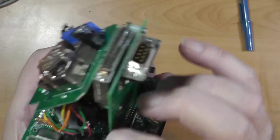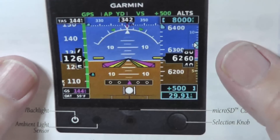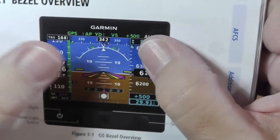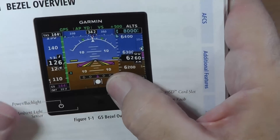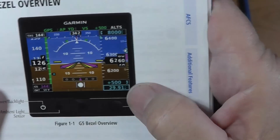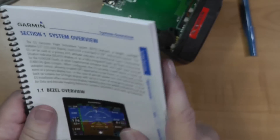The new G5 is about a third as big as this — much smaller, yet it has a full screen on the front. It uses a computer-style screen to provide the information. Here's what it looks like on the G5: it gives you the artificial horizon with the blue and the brown, plus speed, altitude, track, the slip ball, pitch attitude, and true ground speed, because it is GPS.